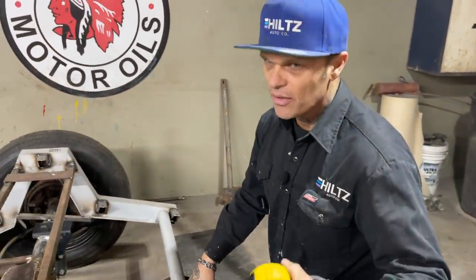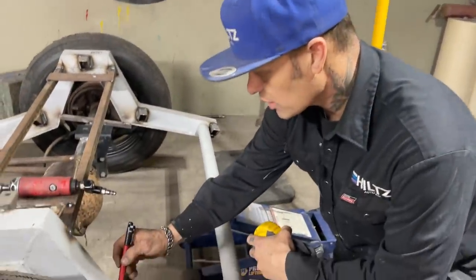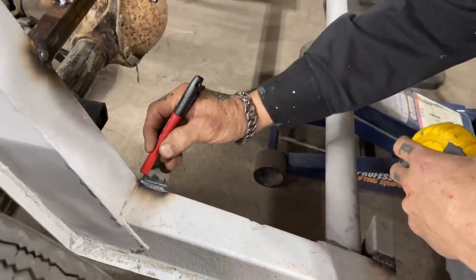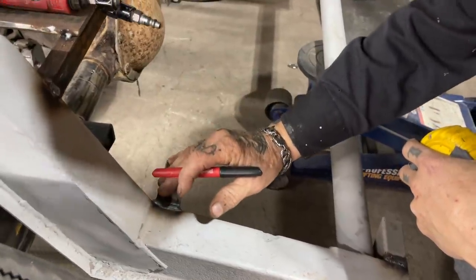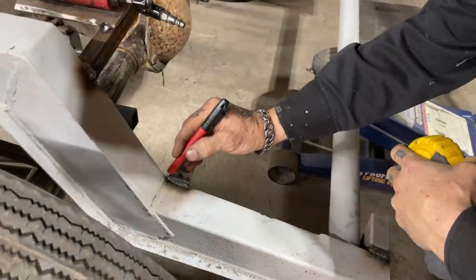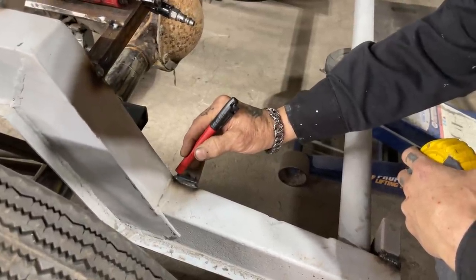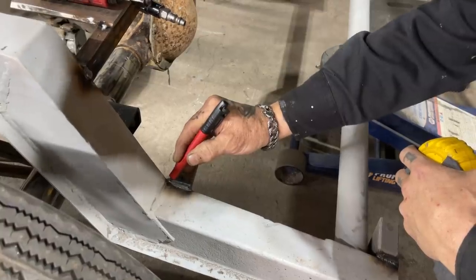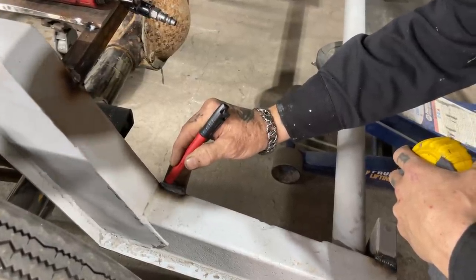So now you know, you can tell by the sound of what you're doing. As I start the puddle, like Zach's doing, Zach's putting one dot on. As I do that, if you're welding heavier stuff and you're able to zap her in and make her hold on, you have to go slow enough to keep the wire in the middle of the puddle all the way down. As soon as you pull it out, it's going to act up on you.